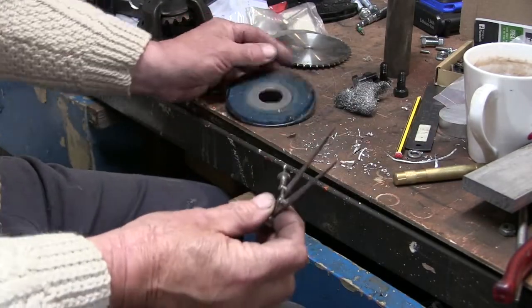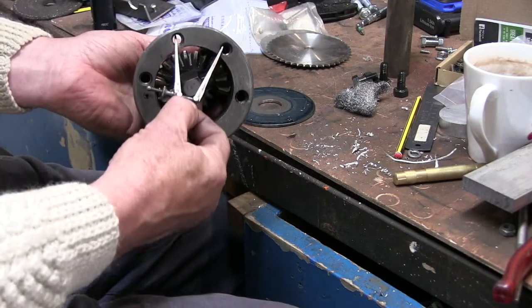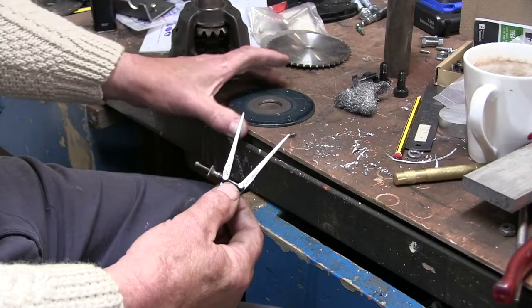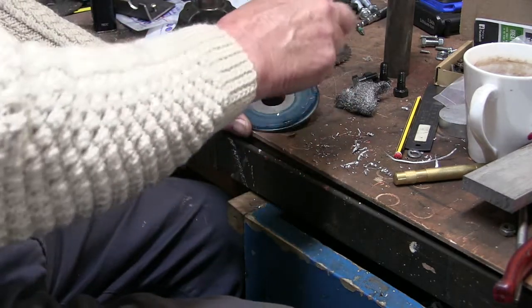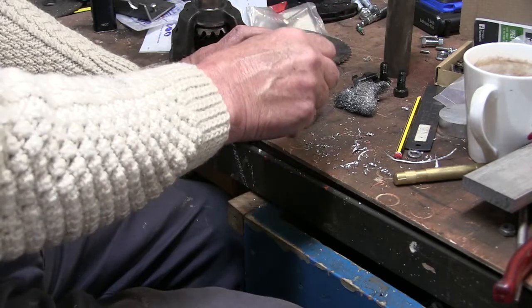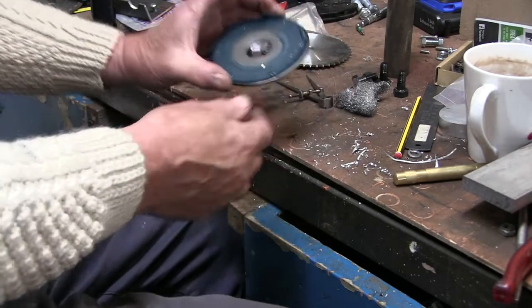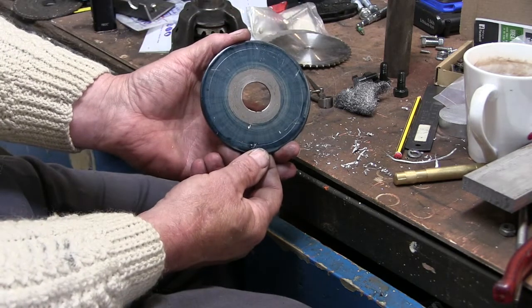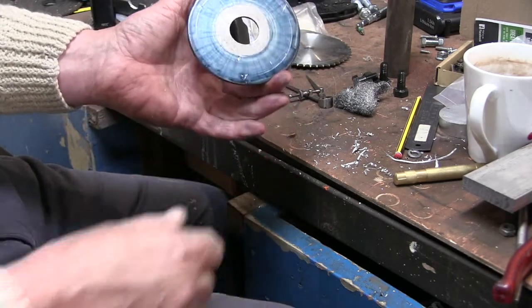I just took a rough divide off of these holes, set the punch on the first one, went round and adjusted it ever so slightly until they came back to naught. So them centre punch holes are in the right place-ish. I'll go and drill it now.